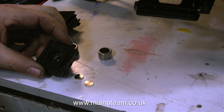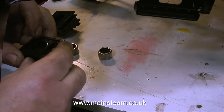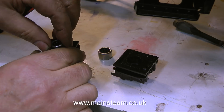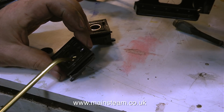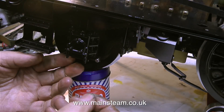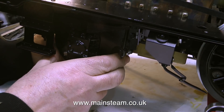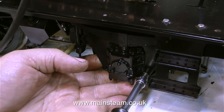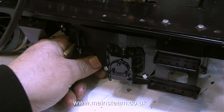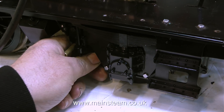After removing the bearings with the brass rod, I put it in the chuck, cleaned off the end, and made two small brass discs. These go in the axle boxes — I put some steam oil in there to hold them in place. Hopefully, if I've got my measurements right, this should allow some side play on the axle, which is essential for going round corners, but the axle will not collide with the frames. With the engine still jacked up using the rolling road unit under the centre axle, I use a Brasso tin under the rear axle to get one of the axle boxes in place. I then turned the engine round and fitted the keeper plate to the other axle box. Now the side play is still there as needed, but the rear wheels can't touch any part of the frames.